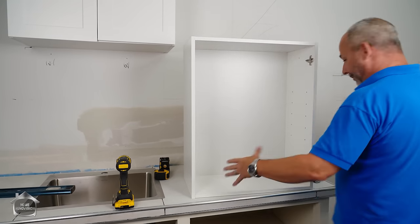That means this door needs to go like this. So let's take a look at the solution here. We have these adjustment screws, and you've got to go in reverse with these to back the screw out, which brings the hinge back in, and that will square things off, okay? The same with this one, same thing on the other side. All right, now this is a nice gap here. This one is not so nice. I probably adjusted too much. I want gaps here consistent. This one, the top, is sticking out too far. I'm gonna make an adjustment there.